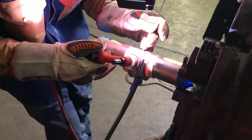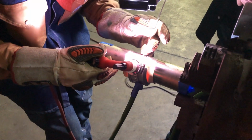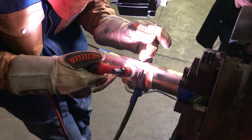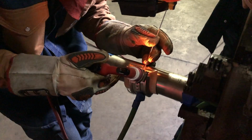Some oxidation on that rod. I try not to have the filler metal corrode, because it'll oxidize. Just keep the tip of the filler metal within the inert gas, because it becomes very sticky. Yeah, it is.